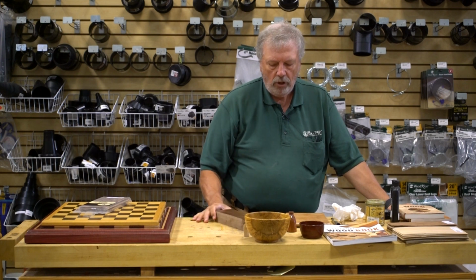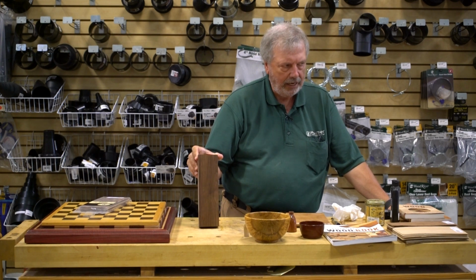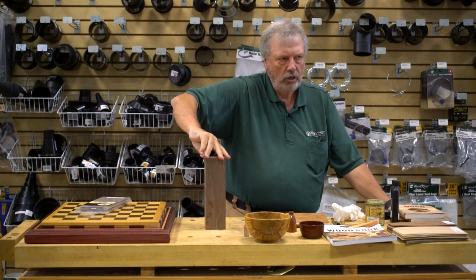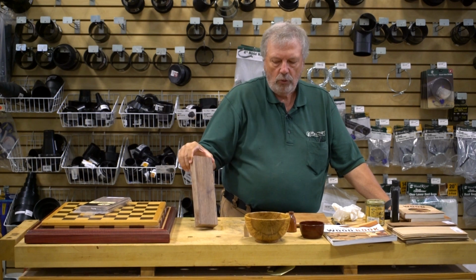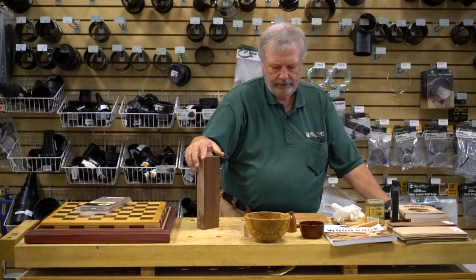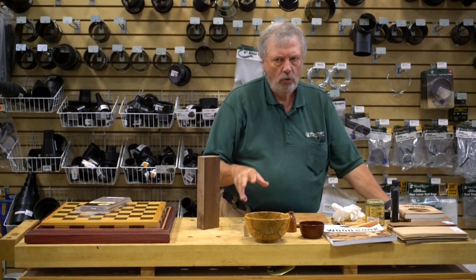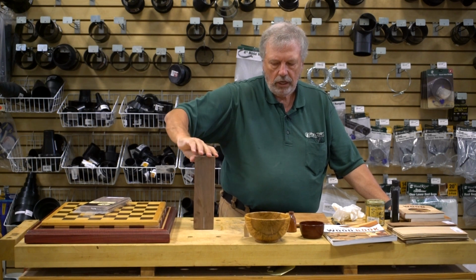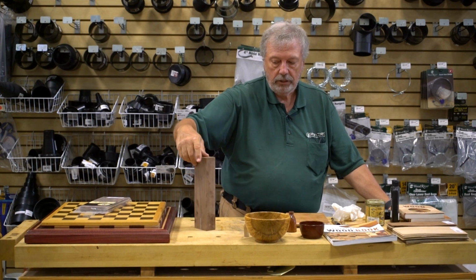We know about our white oaks and red oaks and walnuts. The biggest thing about walnut I can tell you is use an oil finish, because that's going to add an amber cast, and that's going to make the walnut, instead of looking cold, look warm. So when you use a urethane finish or a water-based finish that has no oil in it, it doesn't change the color. It's going to look pretty, but it's going to be cold like this instead of warm like this.